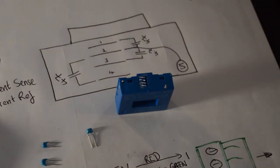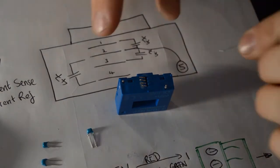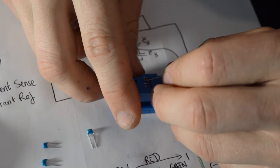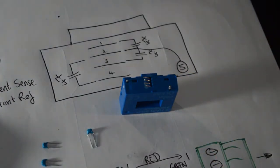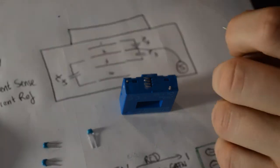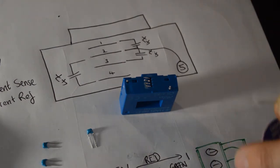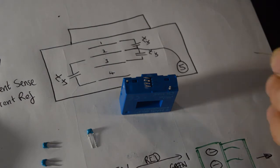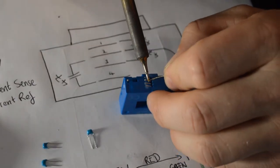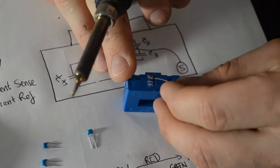Okay, so I'm ready at this point to start soldering the sensor up. I'm going to start by extending pin 2 back this direction with an extra section of wire. That is going to connect to pin 5, as it states in the documentation, both for the LEM sensor and the eChook Nano. So I'm just tinning up a piece of wire. Be careful here not to tin it too much because you will burn your fingers. What I'm doing there, just dropping that on that pin.